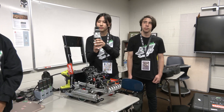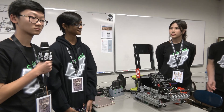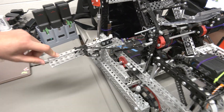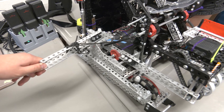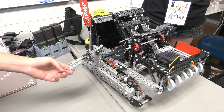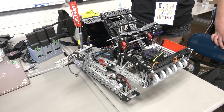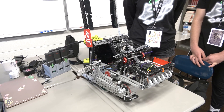Timothy, as we wrap up your robot, talk to me about your elevation mechanism and what's gone into that. Where are you elevating from, and will that meta change for you at all coming from the MOA event to here at Haunted? So we've always had this balancing mechanism to help us elevate on the barrier at the end of the match. It's very useful as it's quite quick and prevents the opposing alliance from match-loading any tri-balls at the end of the round. At the Mall of America competition, a long hang of around 15 seconds allowed the opposing alliance to save their tri-balls until the end, creating a window of opportunity. Our elevation only takes one or two seconds, which closes that window entirely.